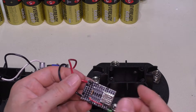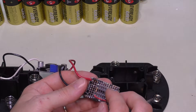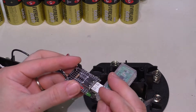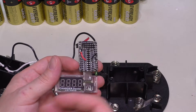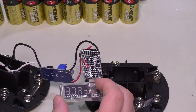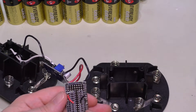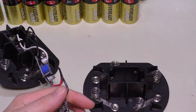Quick charge devices actually pull a higher voltage out too. You won't be able to get as good of a charge off this particular device as you would from a regular default charger. That's evident by using one of these charge doctors — you plug this in and it'll actually tell you how much current is being drawn by the device. You could plug whatever into this and use a regular plug-in charger, and I guarantee you'll get a higher current off that plug-in charger, even though this can certainly supply it. It all has to do with that resistor network, so that'll be something I'll have to address in a future video.